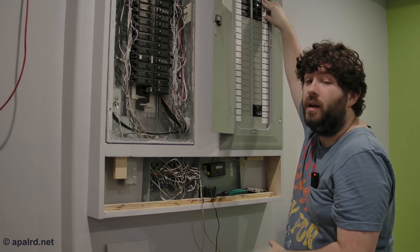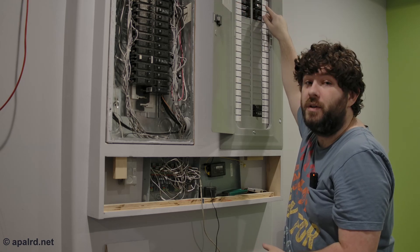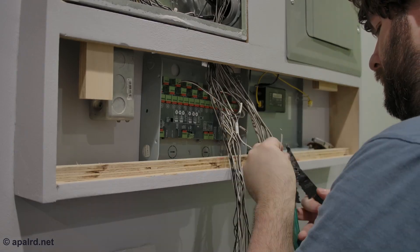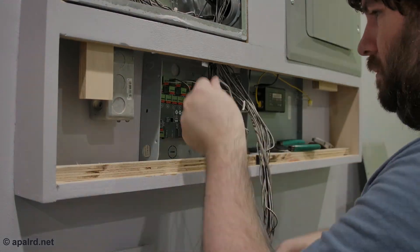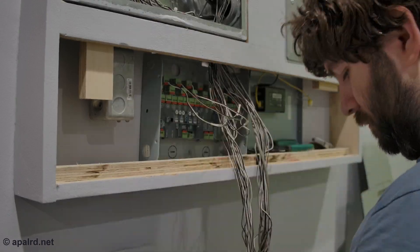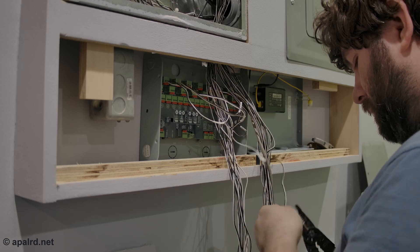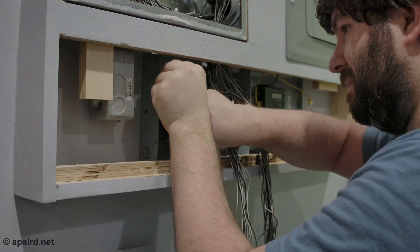The four circuits up here are: the EVSE car charger in the garage, the car charger on the pedestal, the air conditioner, and the oven. The oven is 120-240 split, so it needs two current transformers. The charger on the pedestal is two wires so it only needs one, and the air conditioner is also two wires so I just need one. The garage charger would only need one, but I actually ran a neutral anyway so it has a neutral, and I probably should run two separate transformers.